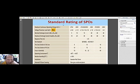So here is a slide that would show you the standard ratings of these low voltage SPDs. Here is the maximum continuous operating voltage. So it could be 275 volts or 440 volts, or it could be 275, 320, 385, or 380, or 400, and 440 volts, or it could be 375, 385, or 440 volts. Okay, so if it is 440, that means it's American standard, and 275 and below, let's say we have 220 volts in our country, so you can also use this maximum operating range.